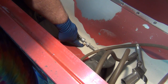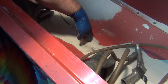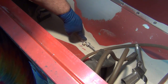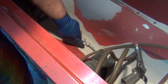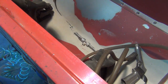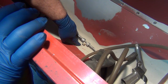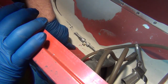Now, I did the T because as gravity goes down, if the hose doesn't have this fresh, clean air coming in, it will just plug up, especially with heavier abrasive. So I basically have a second Venturi effect going here, where the air comes rushing from the hose on the left, goes past the hole here, and sucks up the glass beads. Doing that helps regulate the flow a little bit better, so that I don't get too much clumping where it just balls up and plugs up.